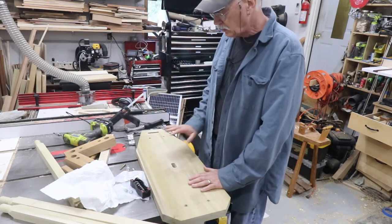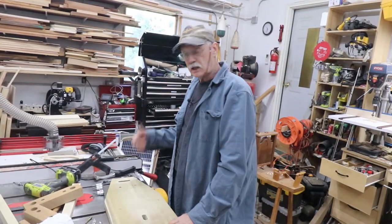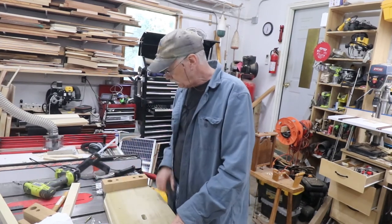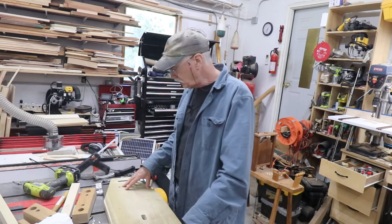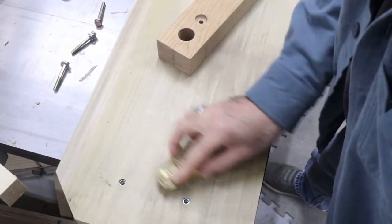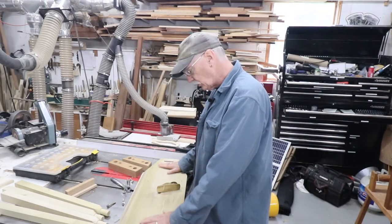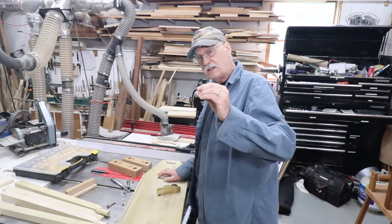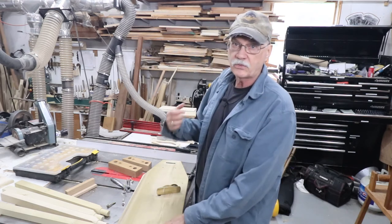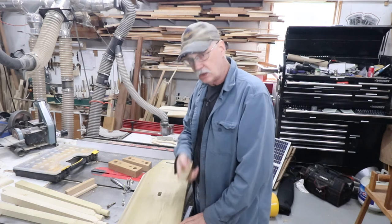I've got to get longer bolts, then mount these in place and mount the legs. But first thing is to plane these down because driving the inserts raised the surface. I think next time I'll go a little bigger than three-eighths on the bit. They're nice and smooth now, level with the surface. One trick I looked up for these larger inserts is to bevel the entry hole about an eighth inch deep at 45 degrees — it aids the insert going in without lifting the top grain of the wood. In this case they were deep and below the surface, and I was able to smooth them up with my block plane.